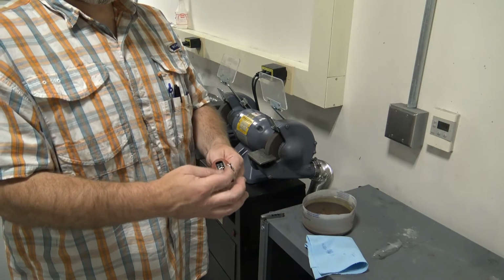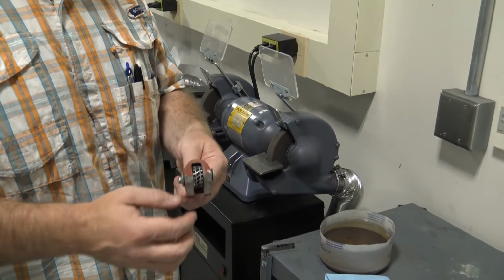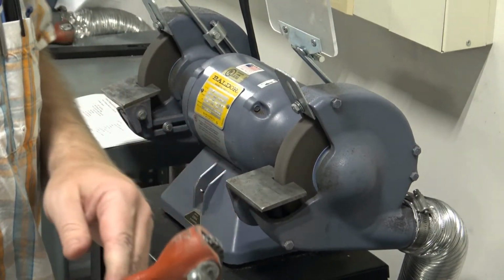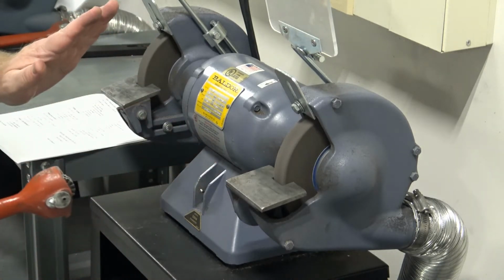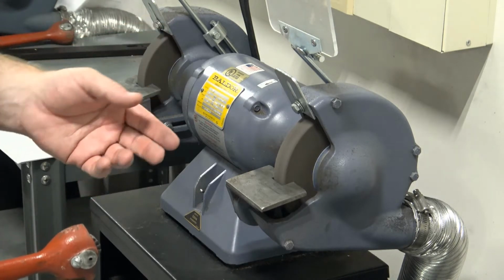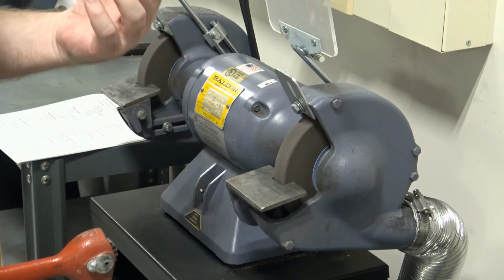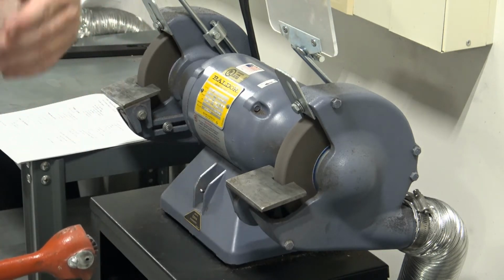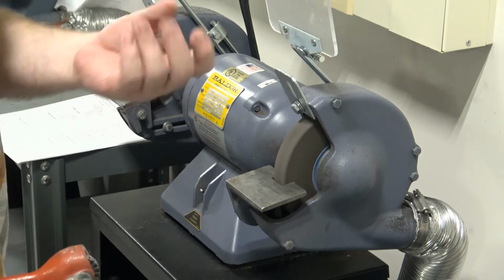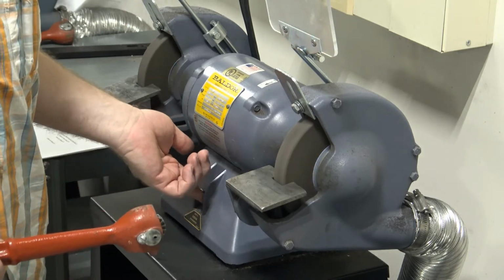These wheels are diamond impregnated, and they spin around at random and break up the outside edge of the grinding wheel. We want to do that in a very smooth and uniform fashion, and it makes a lot of dust and noise, and you will likely feel little particles bouncing off of your skin. It's not going to hurt, but you will feel it. It would be like if you were at the beach on a really windy day. You'll feel little particles of sand hit you. That's about what it feels like. It is loud though.